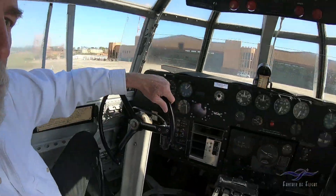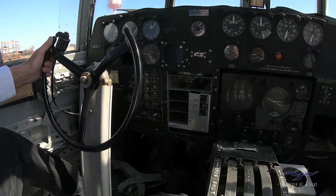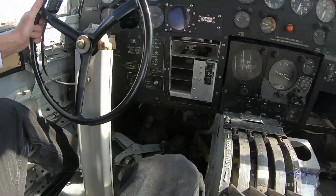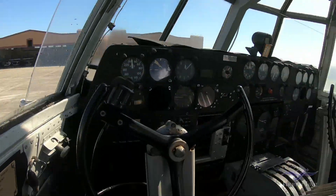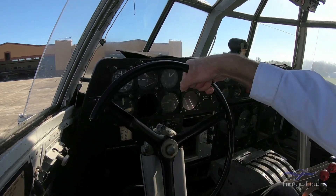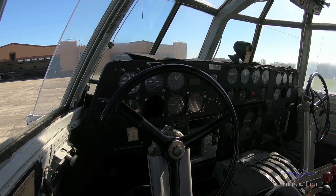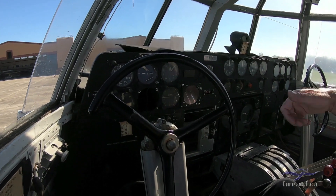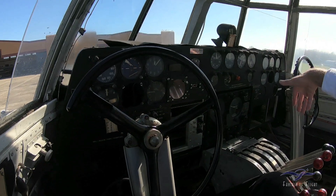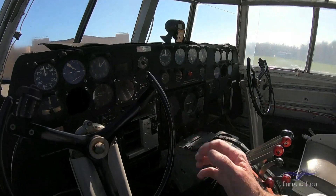What that does with the wind blowing at me — by dropping that aileron it creates more drag on the left side and very, very slowly the boat starts turning. Because of the hull being lined up I start turning to the left. I'm steering with the rudder with my feet and steering with the ailerons. If I want to go to the right, I turn the wheel to the left — the right aileron goes down, creates more drag, and the airplane starts turning right. It's very slow-acting and doesn't respond quickly, but it's the only thing you can do.